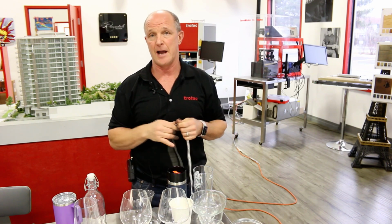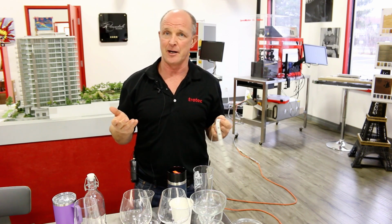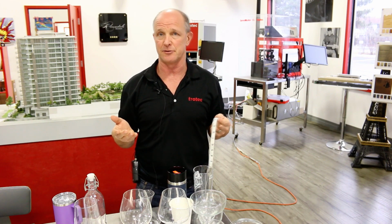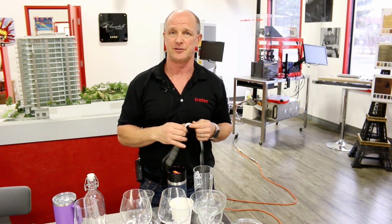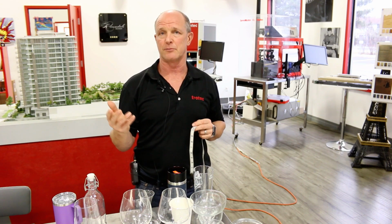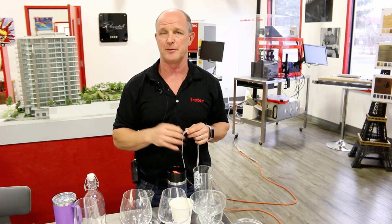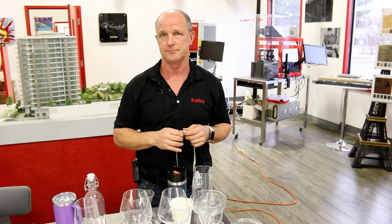If you want to know the diameter of 9.25 inches, that's very easy. You just take 9.25 divided by pi, which is 3.14, and that gives us the diameter. So in the case of the Trotec rotary attachment, you do need to put in the actual diameter, and that's how you figure it out.